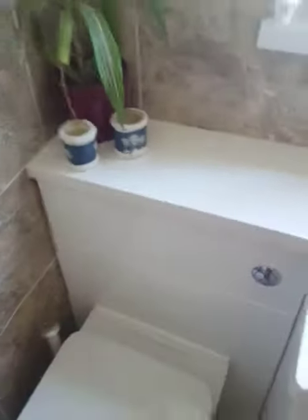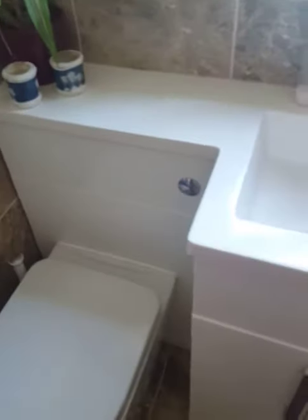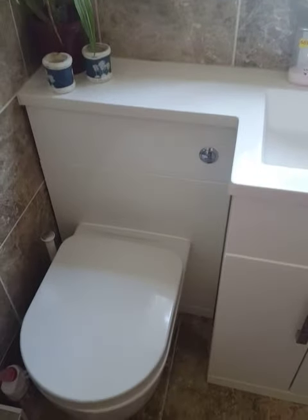Like that. Now for me, it only took a jiggle of this pipe to reset the ball cock, and it was absolutely fine, so I just popped it back on. Obviously I was chuffed to bits, and now my toilet flushes again. It just pushes back on, job done. But I wanted to show people that didn't have a clue how to get into the unit, because I don't know about anybody else, but I certainly had a panic this morning.